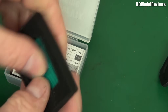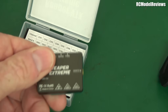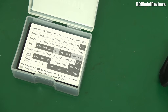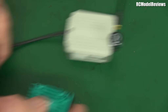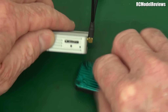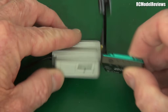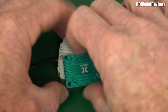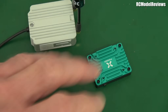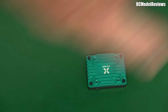Let's look inside. It's actually quite light. Comparing it to the DJI unit — it's quite a bit smaller, especially in height. One of the benefits of analog is it can be really small and really light. That's just a tiny fraction of the size of the DJI air unit. The Vista is smaller but much thicker, so if you're looking for lightweight, you won't get two and a half watts of digital in a package that small.